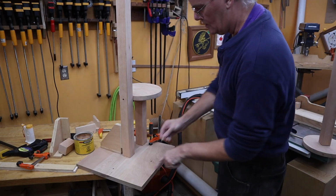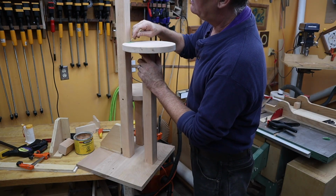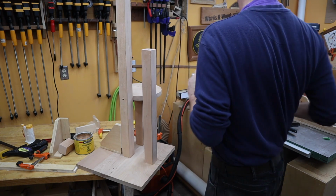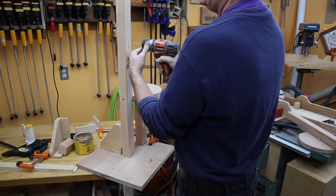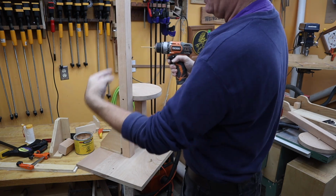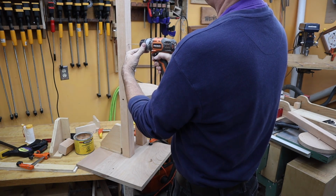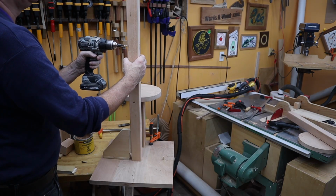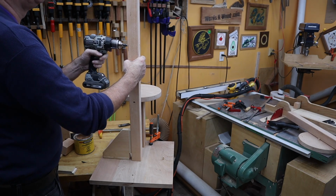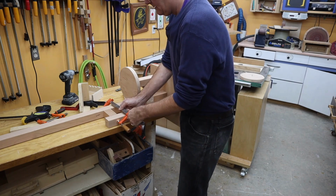Awesome. So now number 2, let's put a dowel in there. And now I can do a little mark here, and that tells me where I need to drill my hole. And I'm going to drill from this side because when I was testing it the first time, I drilled from the other side and the drill went at an angle. So I'm going to drill from the inside first, countersink bit from the outside. A little bit of glue, put the dowel in, clamp them here.